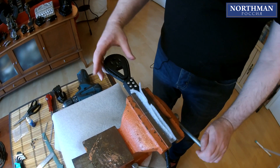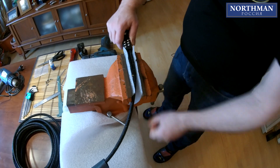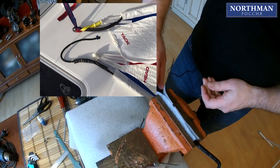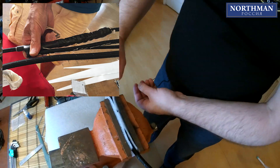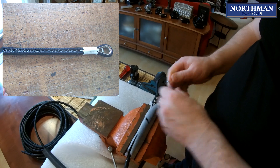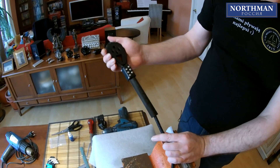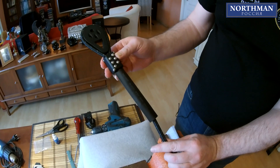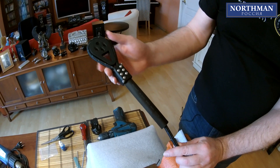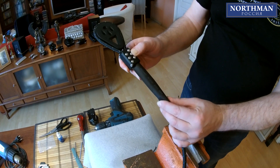It's time to turn the assembly upside down to fix the clamp from the other side. Following our own experience, we strongly recommend the owners of multi-hulls to choose the torque rope one size bigger than for mono-hulls — especially important for code zeroes, because catamarans do not heel and therefore cannot lessen the load when the wind picks up. We also advise to use solid thimbles, double clamps, and to leave a longer tail on the cable with additional sewing. After all the measurements and trial assembly, you should give the soft stay some time for self-adjustment and stretching, checking the system over a couple of test runs with the spinnaker. Following that, you may consider finally cutting the raw ends and finishing them with the heat shrink tubing.